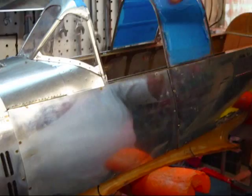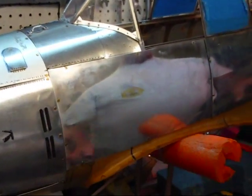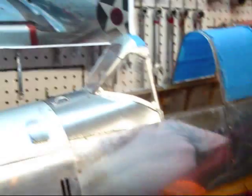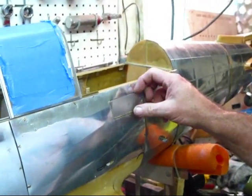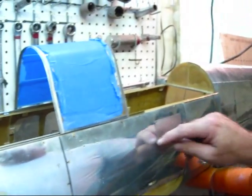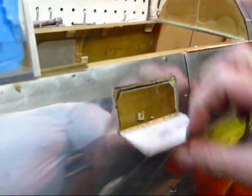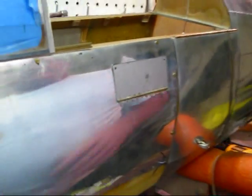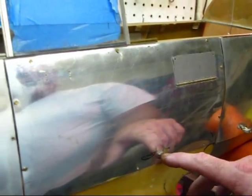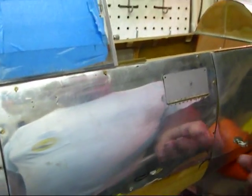I want to get everything done so I can work on the canopy, so I've got all the metal surrounding the canopy coming together. I'm going to save all my compound curves for last - they're one of the toughest things to make. I've got those panels in place, including my fire extinguisher door. On the build thread I showed how to use the back side of an X-Acto knife to scribe around your panel template a bunch of times until it just pops out. I also realized I'll have to remake one panel because my step is in the wrong place - I've got it too far out and need to move it forward.